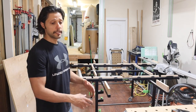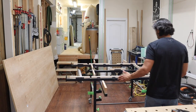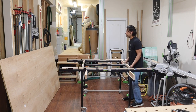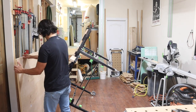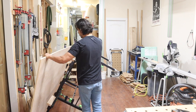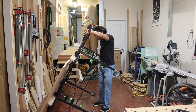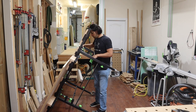I used to break down plywood on the floor with the track saw on foam insulation, but I don't have to do that anymore. I'm going to position the mobile saw station roughly in the center, lock the wheels, and lift the plywood up onto the hooks. Those hooks on the bottom hold it in place. Since I have the wheels locked, I'll tilt it back. I'm going to put my foot here just in case — this floor is a little slippery — and pull right from here, just lean back.